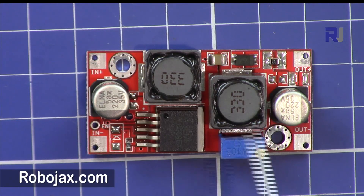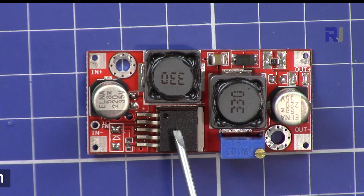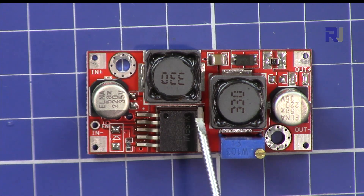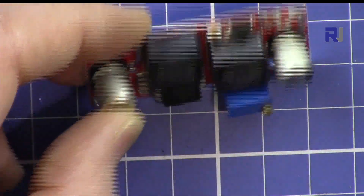This is from XL Semiconductor. The input voltage is 5 to 32 volts and the output is regulated up to 38 volts. The maximum current that this chip can handle is 4 ampere — that's the claimed current for this module — and the efficiency is up to 94%. It has a very minimum number of components.